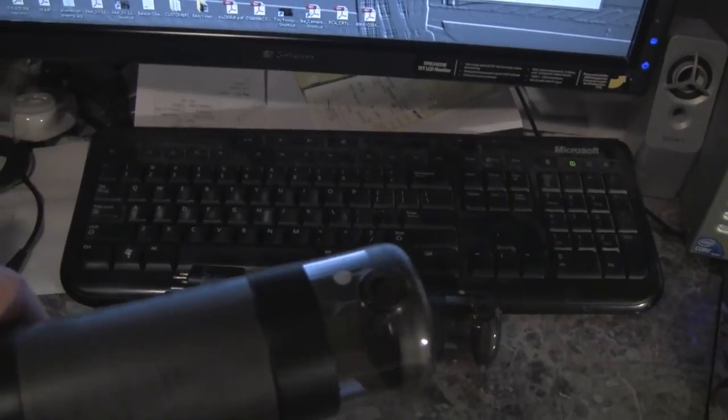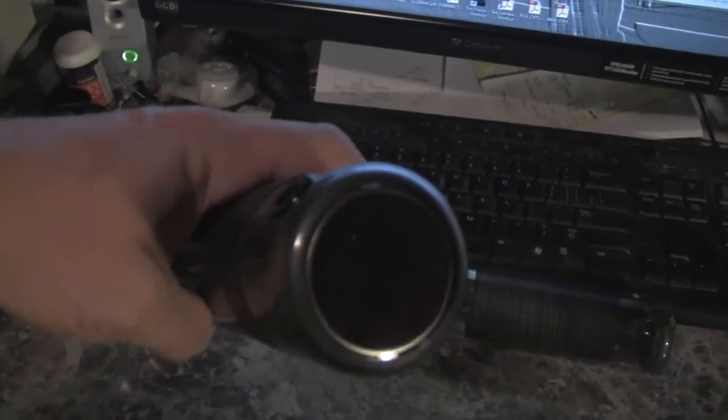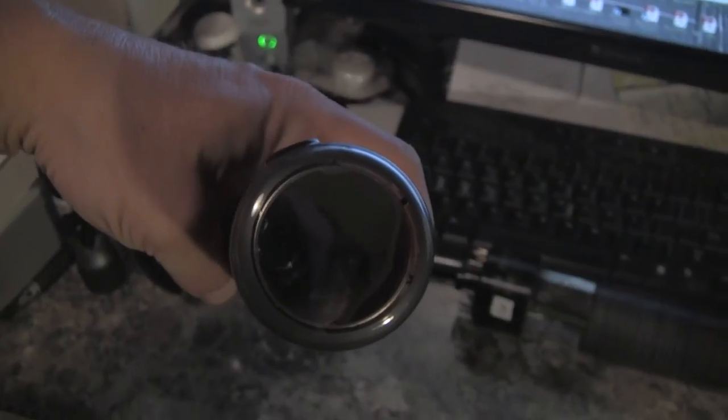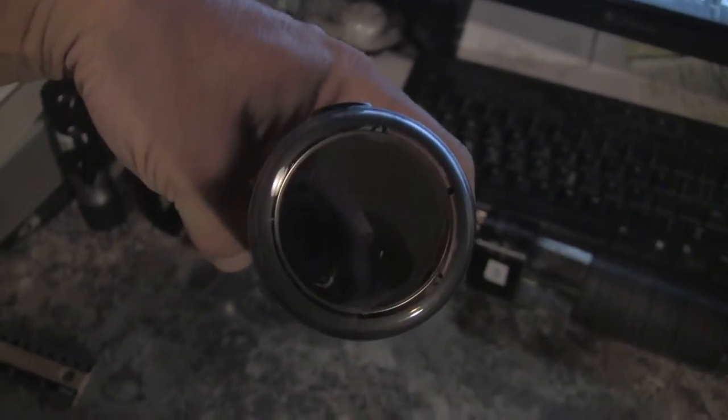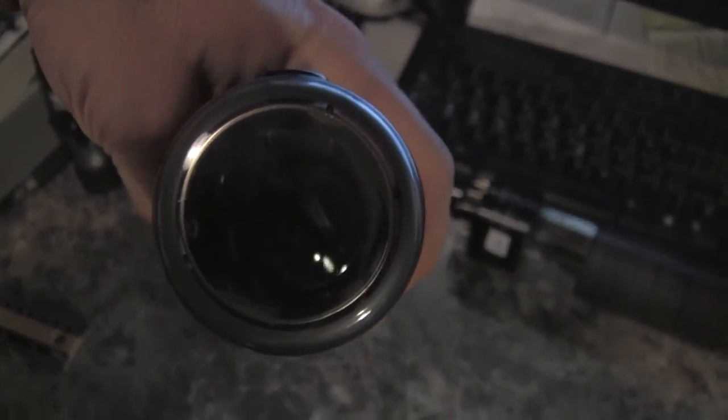As you can see, there's a connector here on the top where you can pick off the signal from the mosaic. This is the part of the tube where you focus the image, and it is then scanned by the electron beam behind that window.